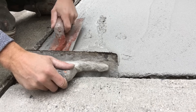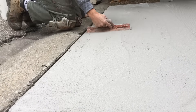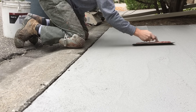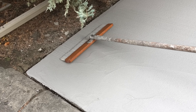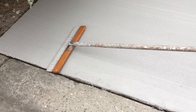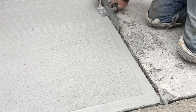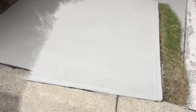I'm bringing a little excess material over to this edge to finish it off, then using my trowel just to smooth out the extra product. It doesn't have to be extremely flat or perfect — all the ridges left with the trowel will be smoothed out and knocked down nicely with the brooming technique. You can see all those trowel ridges there, and as the broom goes over that it knocks them down nice, smooth, and consistent. Note the shallow angle we're coming into the pad with that broom. I'm also wiping the broom onto the adjacent pad to get any excess material off before it drips. And there's that two-inch margin trowel technique again to put in that picture-framing look — not essential, but if the customer wants that look it's a fairly easy technique to do.